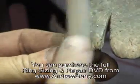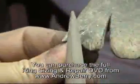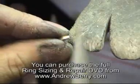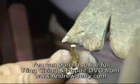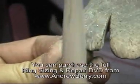So we'll just simply file a flat now on either side. Make sure it's at 90 degrees with the rest of the shank here, and make sure it's perfectly flat as well.